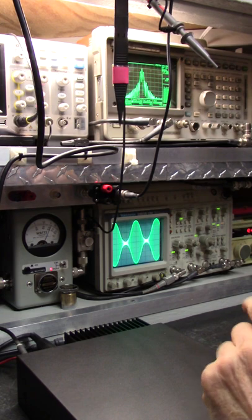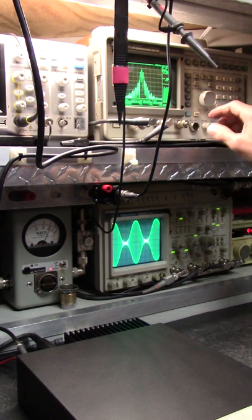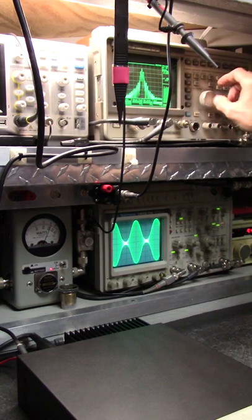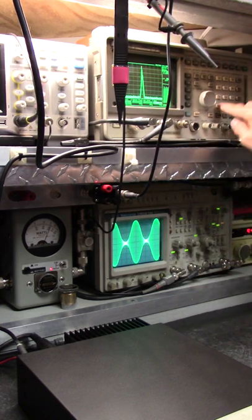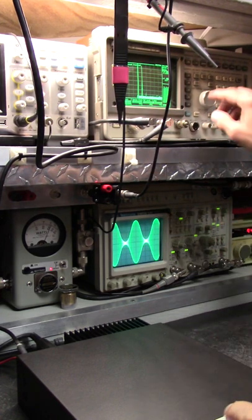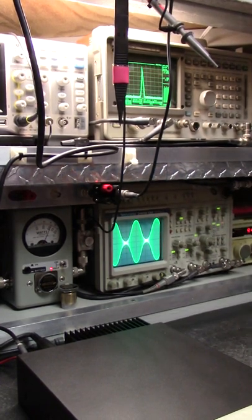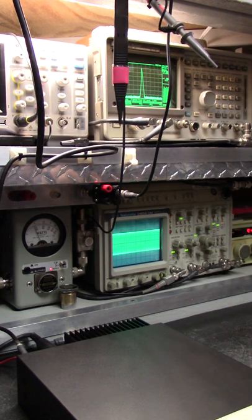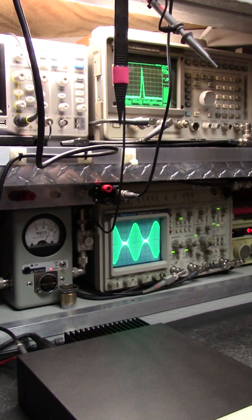That's awesome, okay? That's doing good. For a black box radio, that's doing really good. Power all the way down. Now let's take a look at it. Let's just go straight to 30, 300, and come back to 30. It's doing exceptionally well. Okay? Nothing strange. No spurious emissions, harmonics, and spectrally pure all the way through. It's doing a great job.